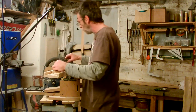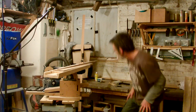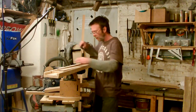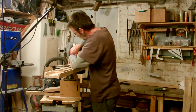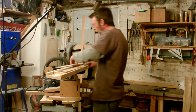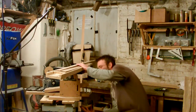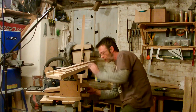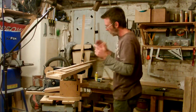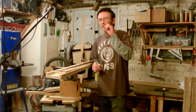Okay, that's still seeing it's about 4 mil at the end there, so I'll just check it in the middle, see what we've got in the middle here, if we can. There we are. Yeah, we've still got plenty in the middle. We're still over about 11 and a half there in the middle. So we can afford to take that up just another little touch. Tighten it up. This will be the last time through for that. If it's around the 3 mil mark, that's fair dues.